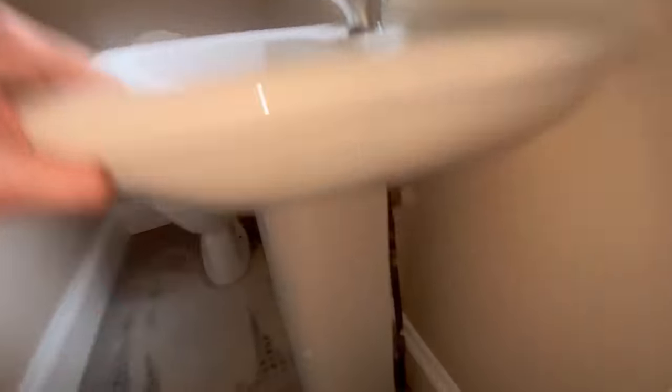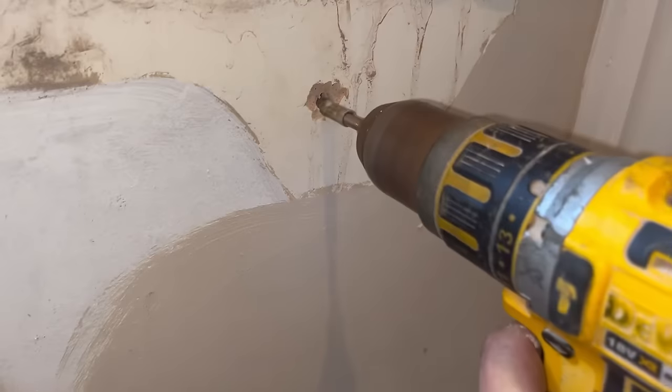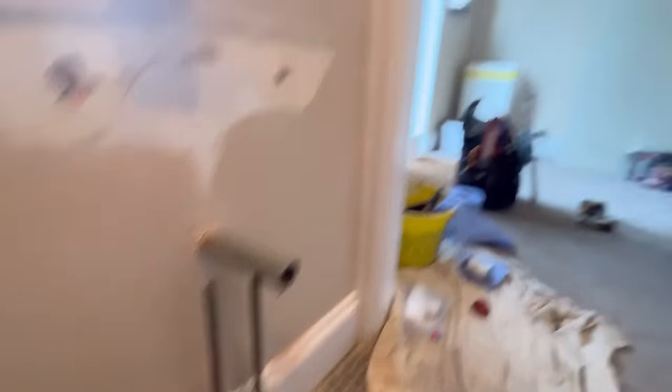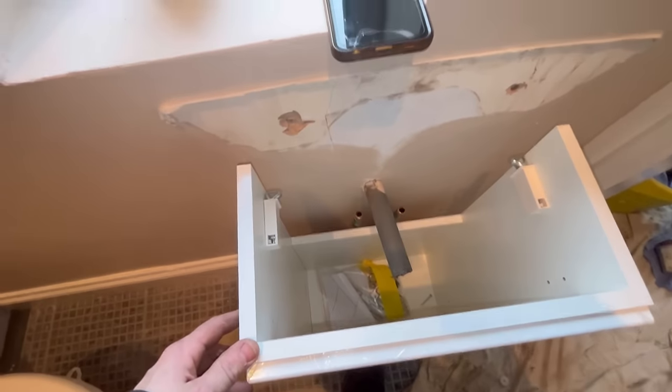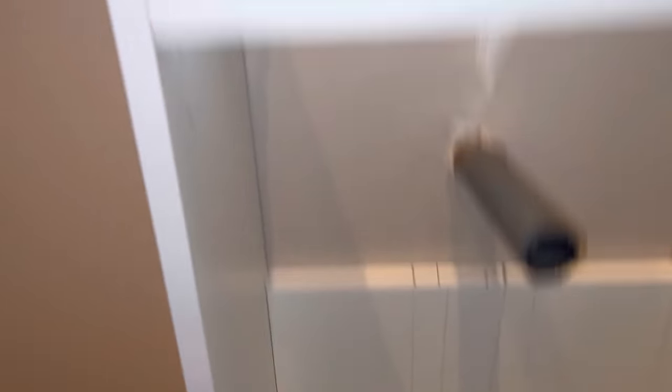I'll quickly show you the upstairs one. This is just a normal basin on a pedestal — what you should be able to do is pull the pedestal out of the way because this basin will be bolted on — same as the other one, two bolts at the back. Luckily on this one there isn't as much silicone at the back. A good trick: if you get these bolts fixed, you can put a combi drill on in reverse and it will reverse them out. We're going to line up the vanity unit, mark either side of the skirting board because we need to cut that out of the way so it goes straight back.